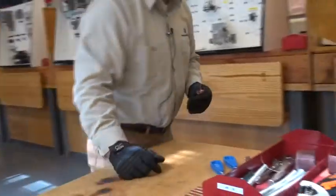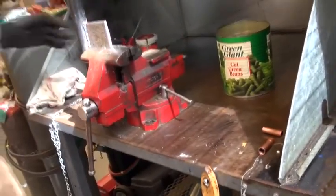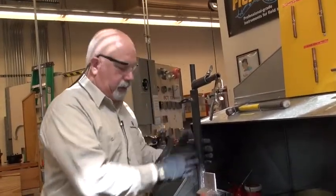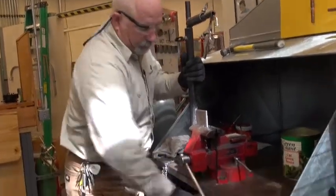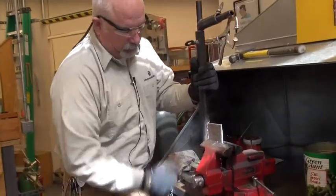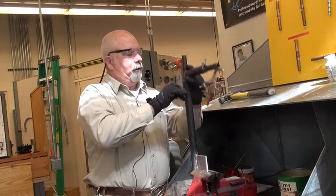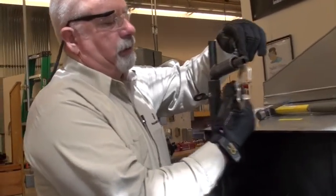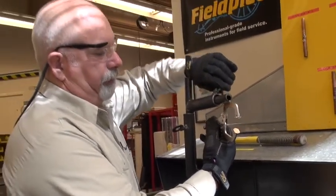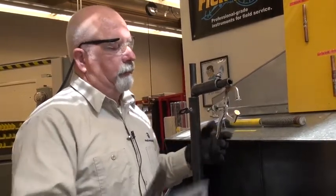Let's take this apart and move over here to our workbench, our big table over here. Now let me explain how this is all going to work. These are going to be located up underneath on the shelf because you don't need them all the time. But you notice it just slides into the vise — firm it up, you don't have to go nuts on it. The thumb screws will allow you to raise it up or lower it down to the lowest setting. The nut on top will allow you to bring out the piece farther than you really need. And the C clamp, which is a flat type clamp, is there so it'll hold the piece.